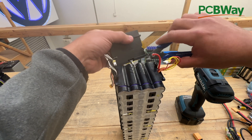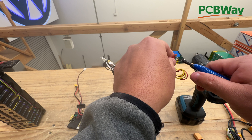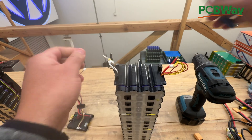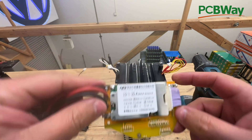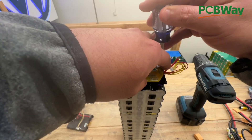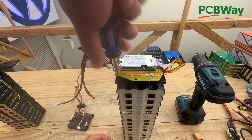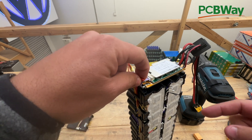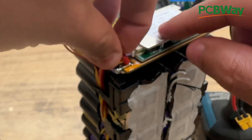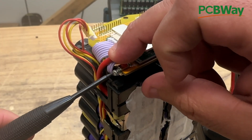You have to cut the wires over here too. Next, strip the red and black wires. Be careful — don't touch anything else while you're doing that because they might arc. Then you install the new board in here. Make sure you don't pinch the wires. Then connect the black wire and the red wire into the terminal here. You don't have to solder anything — you just pull back the screw and tighten it.